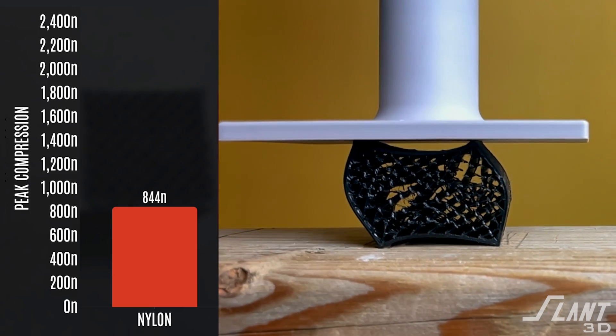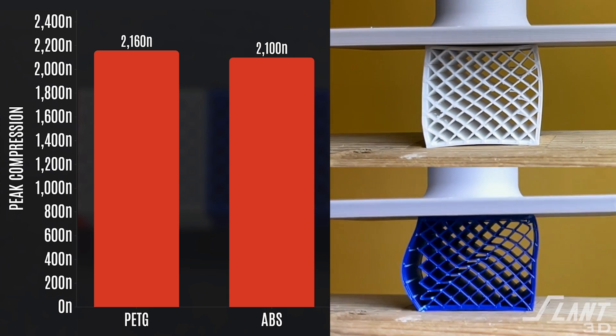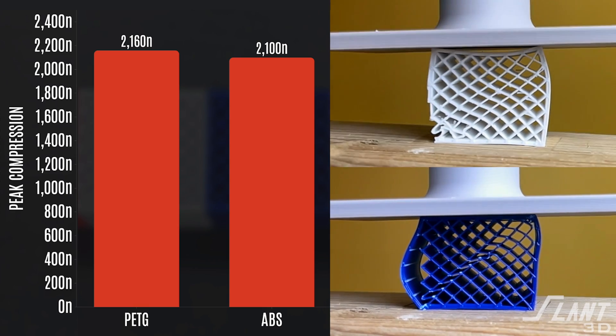Let's look at nylon a little bit here too. Nylon is a lot weaker than many people anticipate, but you have to remember that nylon is really just one step above TPU. It's very often used for flexible type parts like hinges. But it's known for its durability — in machined parts it's known for chemical resistance, its ability to take all kinds of beatings, temperature resistance, and not suffer catastrophic failure. It's exceptionally durable. Then you have PETG and ABS, which are two sides of the same coin — both semi-performance materials, very often used in traditional manufacturing for water bottles, gadgets, widgets, and toys. They're both middle-ground materials that are low cost but have good general material properties.